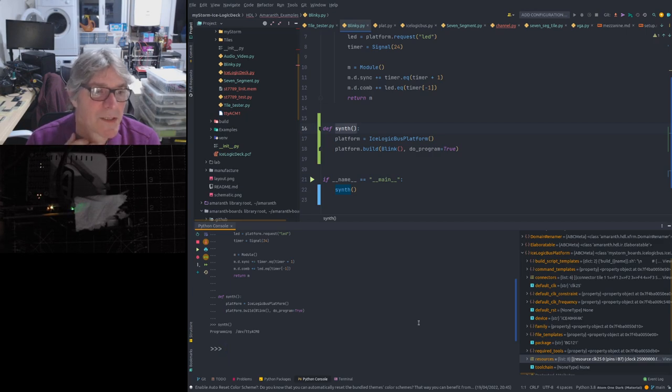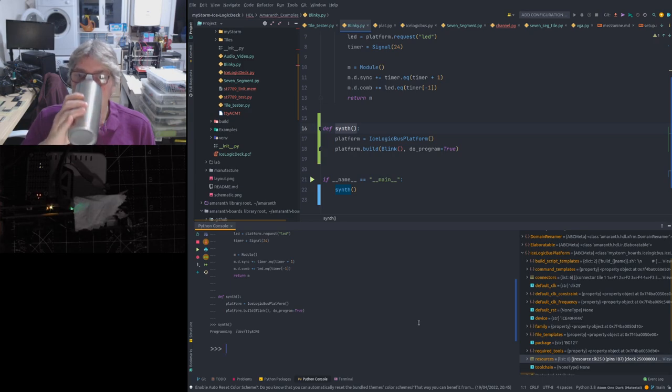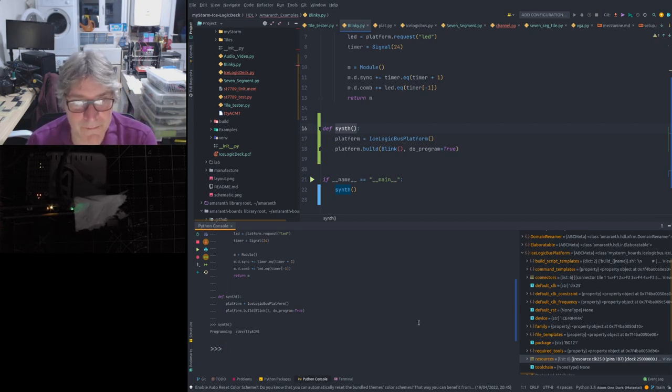So what I might do, instead of connecting that green LED to ground directly, so we know it's on the power, is I might take it to the CS pin on the Ice 40. Why would I want to do that? Because then the pin will change state when we're programming it slightly. So it will give us another indication of programming to illuminate when we're programming. And that is an aid from a diagnostic point of view.